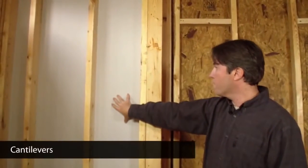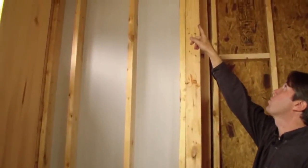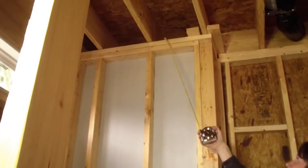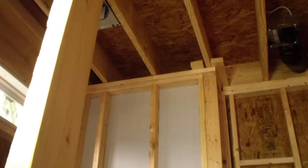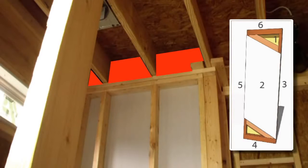Still in the first floor, we have an interesting detail: in the corner of this home there is an exterior closet that will be unconditioned. This wall will be insulated, and above it the second story floor system continues over it essentially as a cantilever. The insulation installer will fill this cavity with insulation and then come back and cap the end with an air barrier — any rigid material that can stop air — sealing it to create a six-sided assembly for that insulation, ensuring outside air can't enter the floor system.